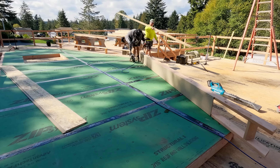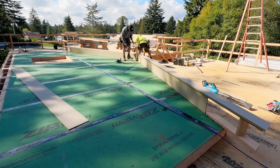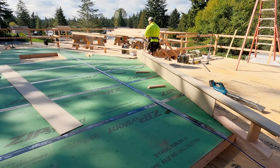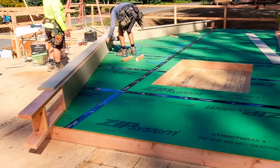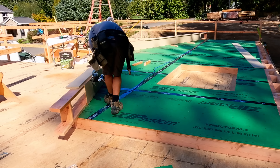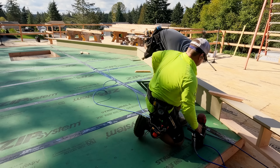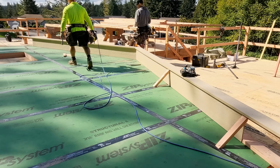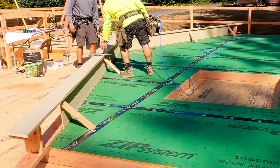What Kyle's doing is nailing off six inches on center, because we're going to make this act like a beam or a strong back, with siding nails and the siding gun. While he's doing that, he can work it so it's nice and flush with the top of our overhang framing. Then I'm just grabbing the LP SmartSide — and this is not sponsored, we just love those products. I'm a huge fan. Five-quarter by eight LP SmartSide trim. I put the plumb cuts together at the top. Also, when you do the overhangs, put a piece of metal across the overhangs behind the fly rafters or barge board — that'll keep them together as you lift. We've calculated the diagonal for our bracing, push up so that it's square to the wall plus an eighth, and then nail those.